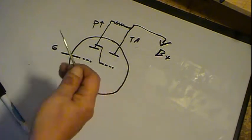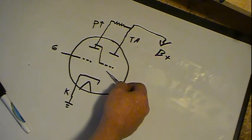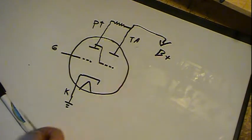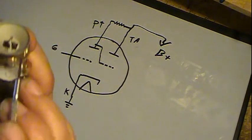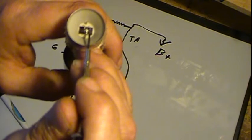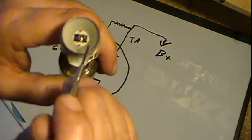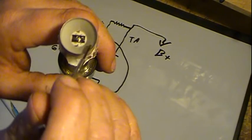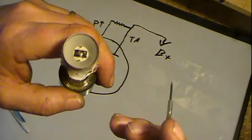And a real deep tube theory explains how that works, but basically what that does is it starts blocking some of the electrons coming through here, because this is less positive and appears more negative with respect to the plate here, and you'll start blocking the electrons hitting the target, but only in this area right here. As this starts blocking electrons, it appears more negative to this plate right here, then the electrons coming from here bend away, and as they do, they start creating a shadow. None of them are hitting in a spot here, so you don't get any of that green phosphorescent color.